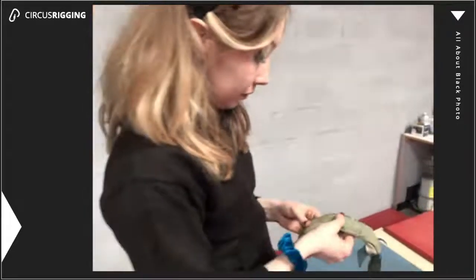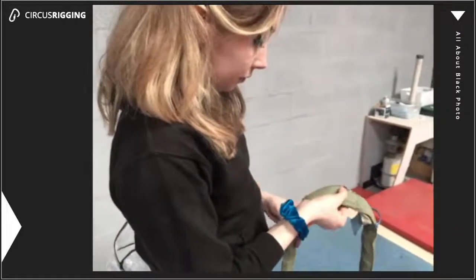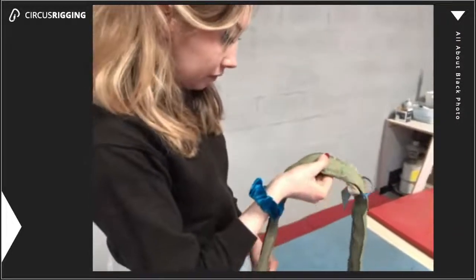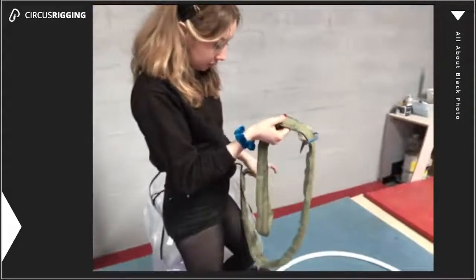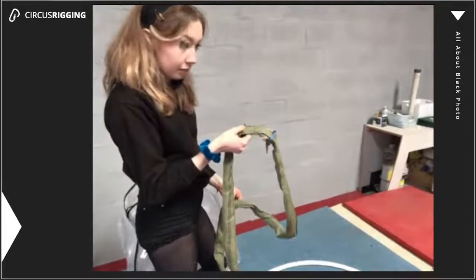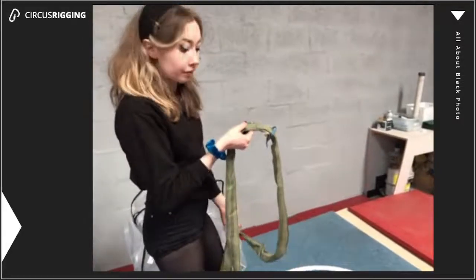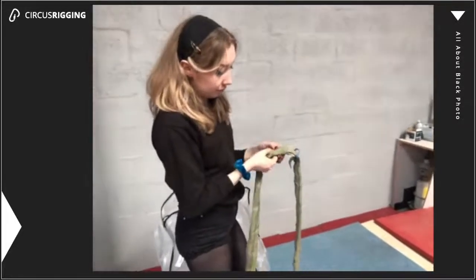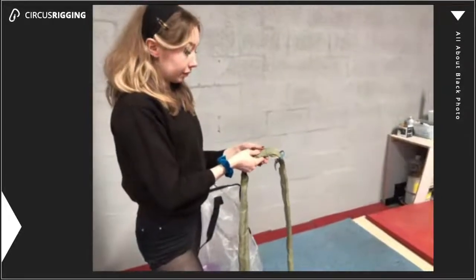Now, if you found something like that somewhere else in the sling, in other words, away from the join, then that's something to be concerned about. Sometimes you find two smaller versions of that, and that's where they've taped the ends of the coil of yarn to itself inside the sling. Occasionally, depending on the quality of the sling, they're paper masking tape, but that's what's going on inside.